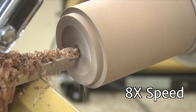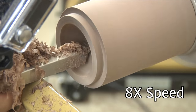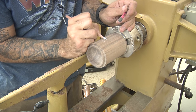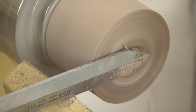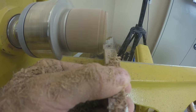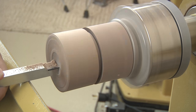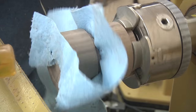With the lid off, we can start to work on the inside of the base — this is just like the work we did on the lid. Go as deep as you like and keep the tenon wall at least 3/16ths of an inch thick; you could go thinner, but that starts to get a little fragile. Use a depth gauge to transfer the depth to the outside, then draw a line about a half inch down from there. That's the bottom of the box and we'll part the blank right on that line. The remaining nub in the chuck will now serve as a jam chuck for the final stage of turning. After a few test fits, we should have a pretty snug connection. I noticed the base didn't feel secure enough, so I used the paper towel trick again to snug things up.